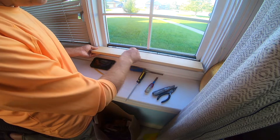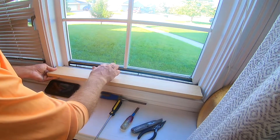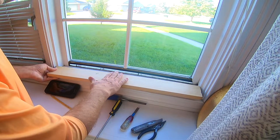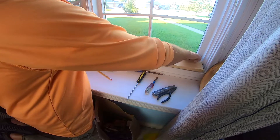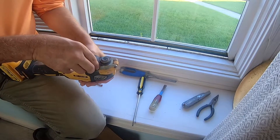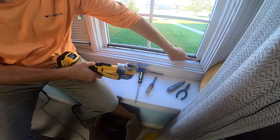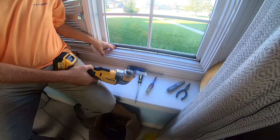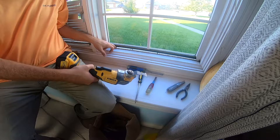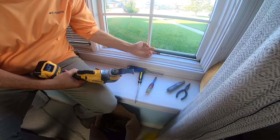So I'm going to get pieces of cedar — a skinny piece and then a little bit fatter piece — and put them in in reverse order. Then I'll fill the voids, especially down below, with foam. We're going to use this oscillating saw to trim up some of these corners. There's a knot down here in the wood that didn't rot away, so we want to trim that up and cut it out. I've also got a couple of screws here that I want to cut out.